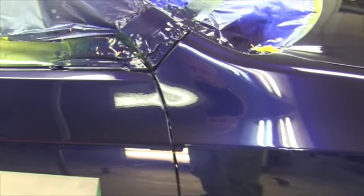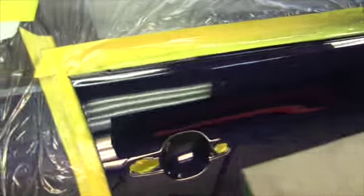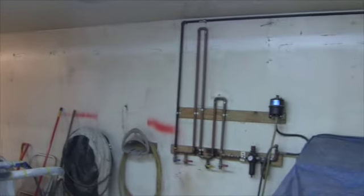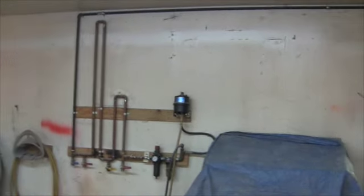Like I said yesterday, you can see some dirt spots. I had a little mishap right here - a drip of water hit it. I think I'm getting water in my airlines again, so we're going to invest in a desiccant dryer or a refrigerated air dryer here shortly. The problem is this floor gets so cold, it's like 50 degrees, and the air in my lines still isn't getting enough time to cool down. It's hot in the shop, and my airline runs across the ceiling where it's hot, so that isn't enough to drop all of its moisture. My toilet paper filter in the motor guard there is clean, dry, brand new - it's just not slowing the water down enough. What little bit is left condenses into the airline laying on that floor.